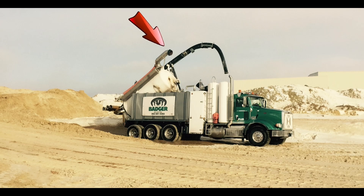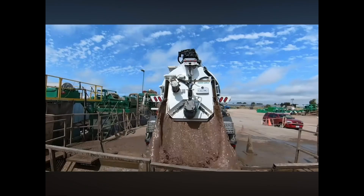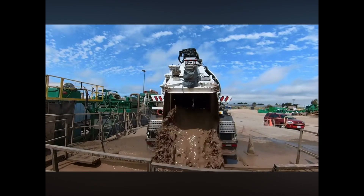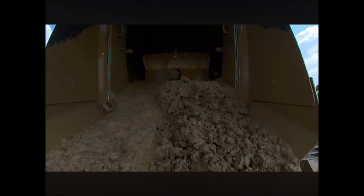The tip-style units have to break the vacuum system at some point when offloading, and have the potential hazard of rolling over or contacting overhead structures when dumping due to the boom height. Here you see the Tornado dumping with the assistance of what we call a debris dozer, which can be installed on any of our F-Series units to assist in more stubborn materials.